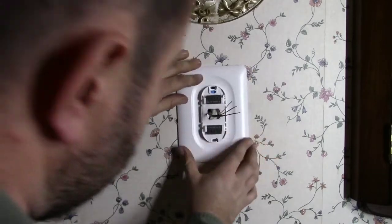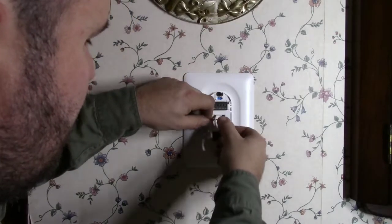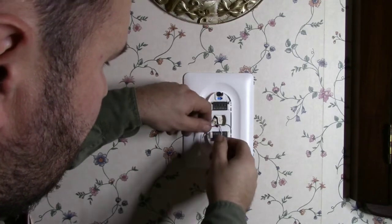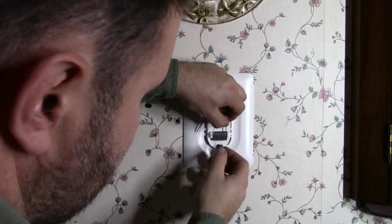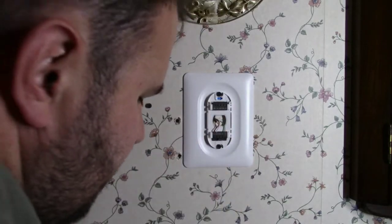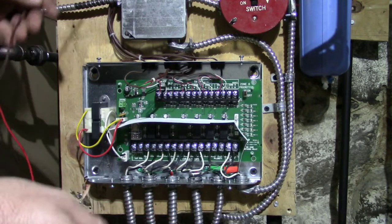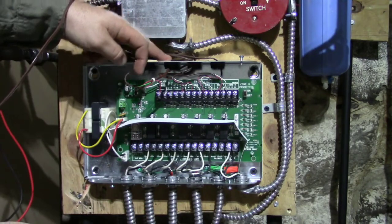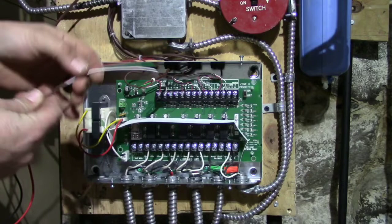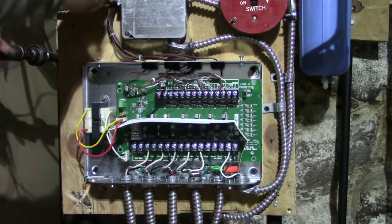Here's the base plate — I'll put the wires through and mount it. Now let's hook up the wires. I'm using my green wire for the common, white for W1, and red for RH. Push the tab down — it's all pushed in, clean. Back down at the panel, I've routed the new wire back into the control board, stripped everything, and I'm feeding it in. Power is off.